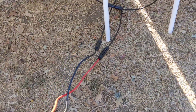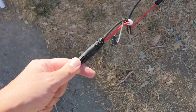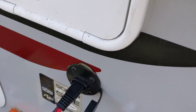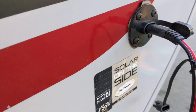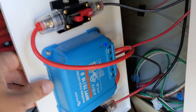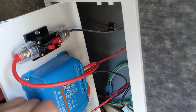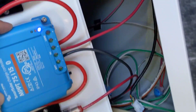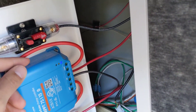I've got them connected in series, and that's the MC4 connector. They go to this SAE little extension connector under the trailer, which goes into my side port. What was really interesting is I actually had to put the black wire into the positive of my PV system, and the red coming from that port into the negative. I tested it a bunch of different times and checked the cables, but that's just what's going on there.